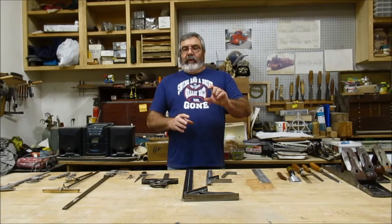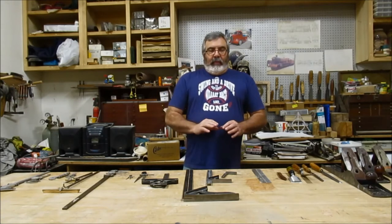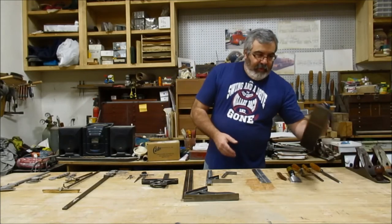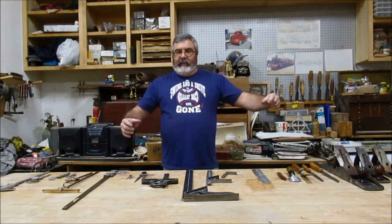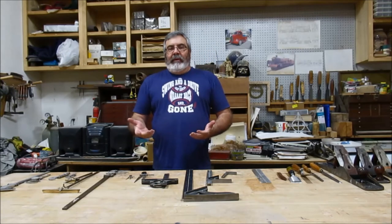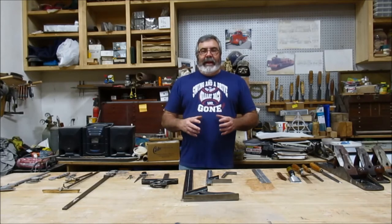We used to make what's called cope and drag boards for the pattern. All we did was take two-inch thick mahogany out of the lumber rack, run them across the planer, put them down on our bench, put battens across them. They weren't flat, and in pattern making everything has to be perfectly flat. We had a big machine called a pattern mill. The older guys would take their boards over and surface everything nice and flat. But Joe, the old German guy, used to make me take out the jointer hand plane. We'd grab a flat board, put chalk on it, rub it wherever the chalk hit, and hand plane. Depending on the board size it would take anywhere from half an hour up to a couple hours, while the guys on the machines were done in ten minutes. Joe made me do it by hand through my whole apprenticeship.